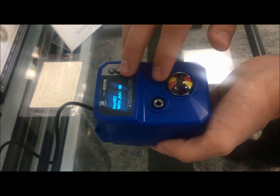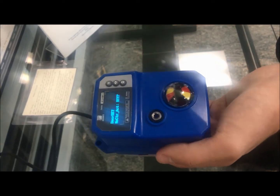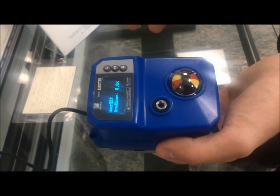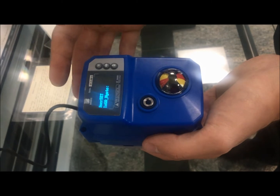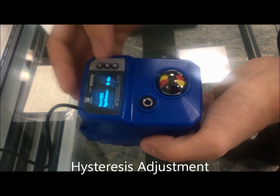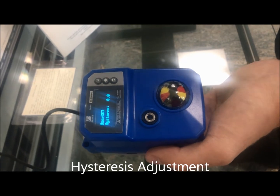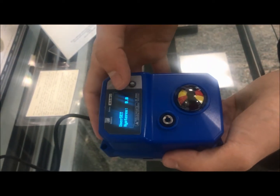However, no control action still needs to maintain power to operate, and it's only offered on 4 to 20 milliamp, not zero to 10 volt. Dead zone is how accurate the actuator will be based on a percentage of its working angle. Hysteresis adjustment accounts for any slop in the ball valve or lag between the ball and the actuator, so you can still maintain great control.